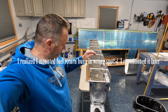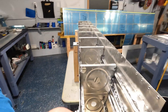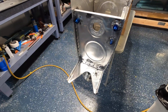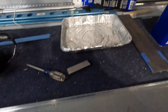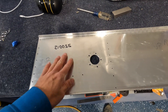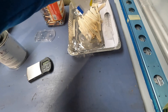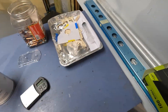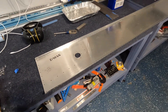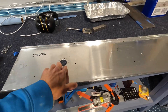Good morning guys. So everything is all done except the rear baffle. I have these fittings torqued in. Now I am doing an extra fuel level sender. So this is what I had to modify from the rear baffle and make. I took a template from the plans, cut it out, laminated it, then made an aluminum template, traced it, cut it out, and riveted it on the nut plates with screw holes to hold the fuel level sender in.